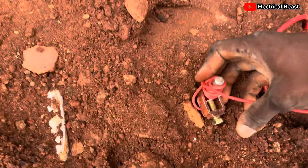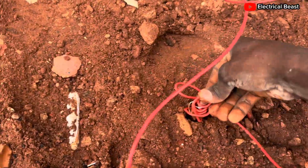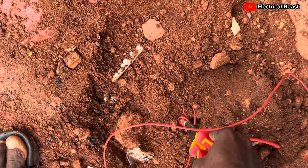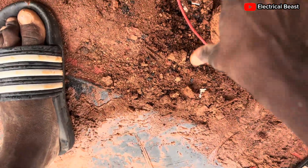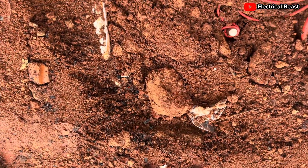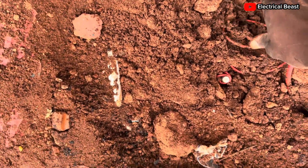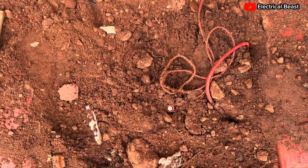All right, I've done that already and everything is fine at the moment. All I have to do now is take the rod down, bury it, and also the wire too, so when the decision comes you can see that I've added something to it. When you want to do earthing, try as much as possible to go for bigger cables — 6mm at least, 10mm or even 16mm cable — because earthing is one of the most underrated yet essential things in any installation.